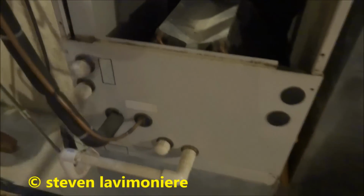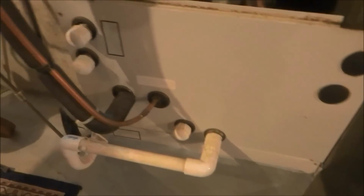Where a leak is, it's coming right from that Schrader core. I'm thinking I could pull that out maybe and put a new one in there. We'll try. I'll magnify it with the camera so you can see it. It's leaking right from the Schrader. I just loosened it and it's not supposed to be leaking like that, so I'm going to pull it out and put a new valve in there, and then we'll put more nitrogen in, and we'll try it again.